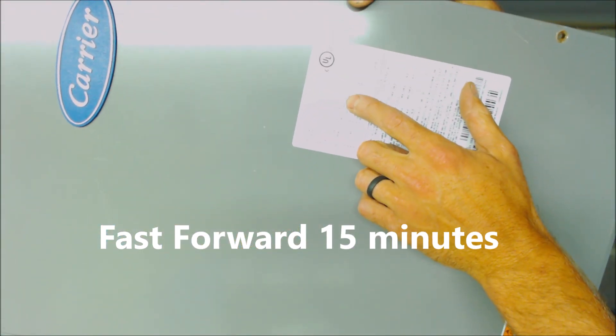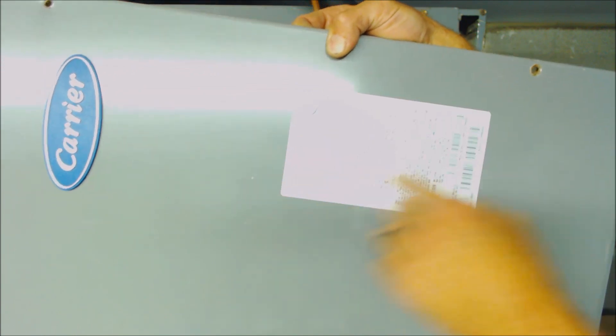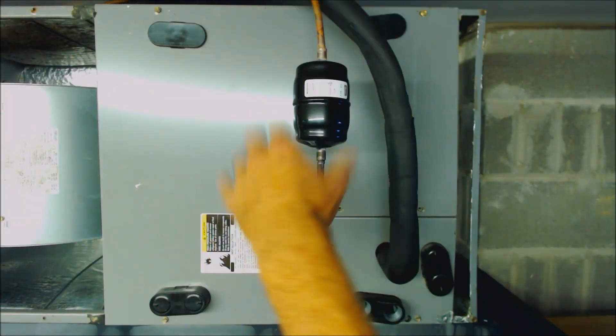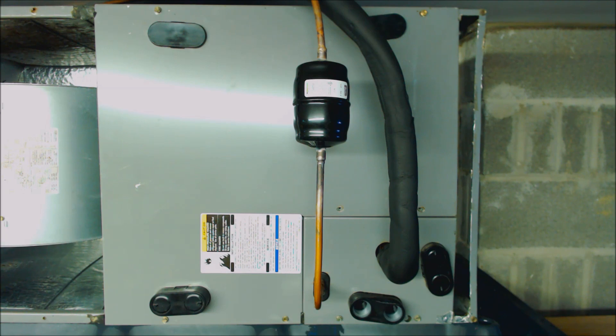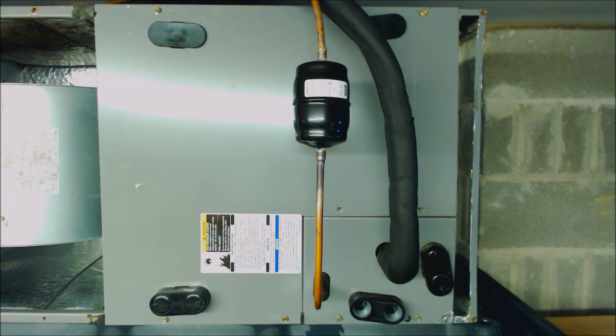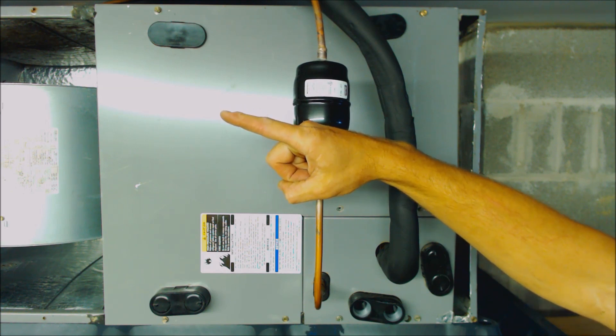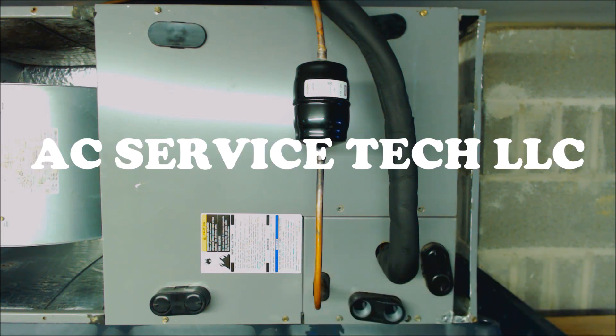I already pressure tested up to 350 psig. The max design pressure is 450 psig at the indoor rating plate of the air handler. Make sure you don't exceed that — on older air handlers or evaporator coils that don't have a rating plate, they may be pressure tested only up to 150 psig as a max design pressure. Just make sure you don't over-pressurize the system, which can make leaks instead of helping you find them. Leave your pressure test on for about 10 minutes, then release it and do your vacuum. If you're looking for tools used in this video such as the nitrogen regulator or nitrogen flow meter, I have them all linked in the description below. If you want to support this HVACR training channel, subscribe, or see related videos on nitrogen flow or pressure testing, click the links — hope you enjoyed it and we'll see you next time at AC Service Tech channel.